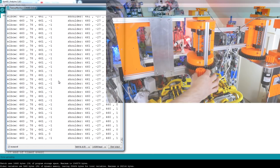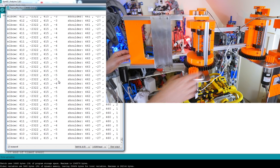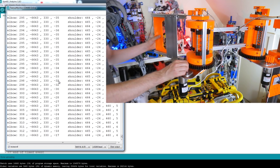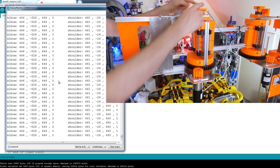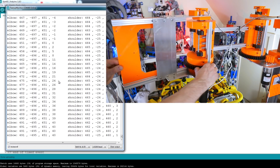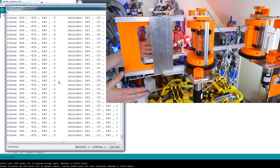Now if we manipulate the arm, we should see that if we just move one axis, that force stays around zero wherever we put it — there is a little bit of backlash I still need to account for, as I mentioned last time. But if I actually grab that axis, block that gear, and move it, we can see it goes positive in one direction and negative in the other — and it does that wherever we are, because we're matching the encoder values with that scaling function. We'll probably need to filter that, but we can do several things with the force value, including driving the motor so as we push this, the motor will actively turn and we can leave it in a position — or of course just measure the force if the robot collides with something.